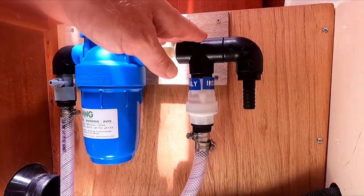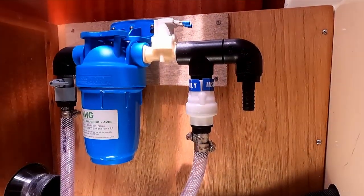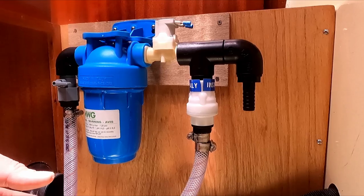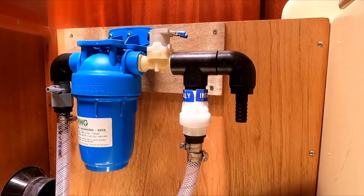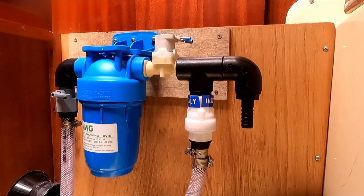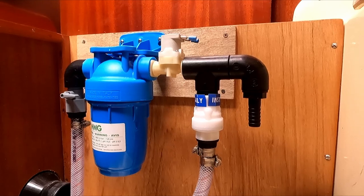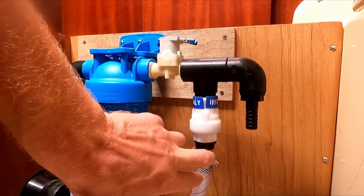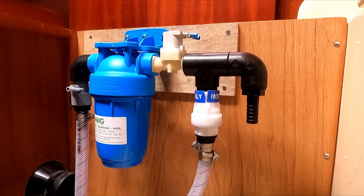So if this one breaks, there will be a seawater inlet, which you can't hear because the pump is not switching on, and that will run forever. Well, of course, we hope our bilge pump will ring and sound an alarm, but that's why we have two hose clamps here, because this is from the seawater from outside and this is only our freshwater system.